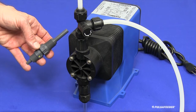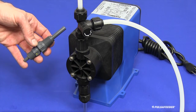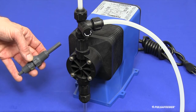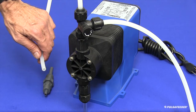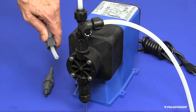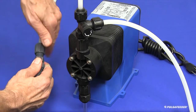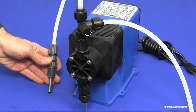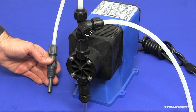The injector has a ½ inch NPT male thread intended to be inserted into a ½ inch NPT female thread for connection to the service. The thread on the injector should be wrapped with Teflon tape prior to insertion and tightened moderately tight with a small wrench. Cut the discharge tubing to the appropriate length and attach in a similar fashion — slide the cap onto the tube, press the tube onto the injector nipple, and tighten the cap by hand as firmly as possible. If the pump is feeding directly into a sump without a pipe connection, the injector must still be used, as it provides back pressure for the pump and prevents service fluid from mixing with the chemical in the discharge tubing.